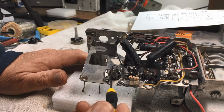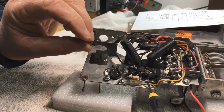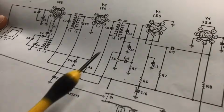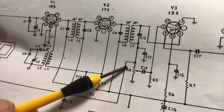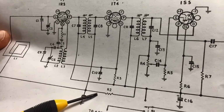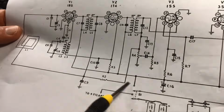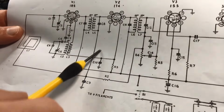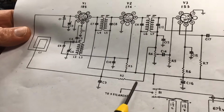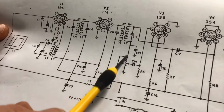The next thing I think we'll start. I replaced this black wire that comes from that point at the 100 picofarad. It goes over to the volume control. Now, if we look here, C13, and it goes down to one end of the volume pot. So yeah, and we've got to check this resistor as well, which is 2. So obviously on some sort of AGC line there, or it looks a bit of a strange arrangement here with the loop. So I'm not real sure about this one, but anyway, that was him. C13 goes to the one side of the volume pot.